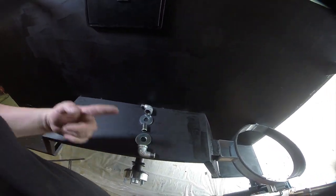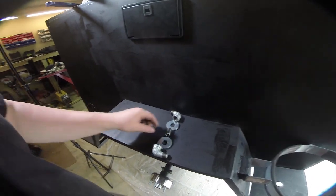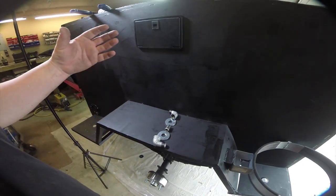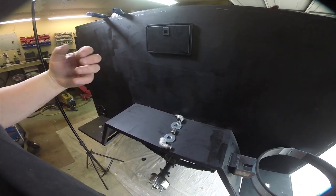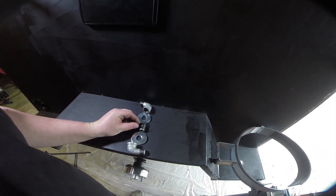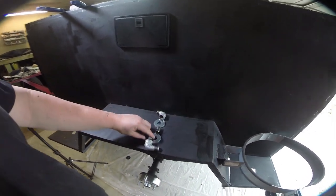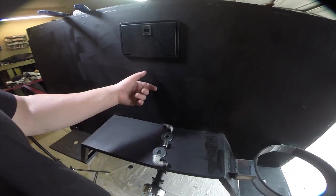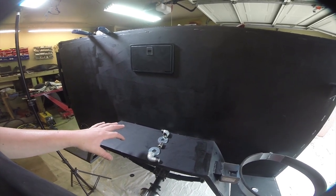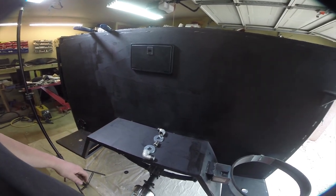This is a galvanized T that's going to go right here, hooking to our propane tank using this close nipple. Because these are MPT threads, they basically expand in a conical shape as you tighten them, giving a good seal — but that means you'll end up with about 0.4 inches of difference. I don't want this rotating or bouncing around inside, so we're going to use these washers to basically weld on and make a spacer. I'll figure out exactly how many washers I need, then tighten it up fully.